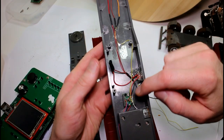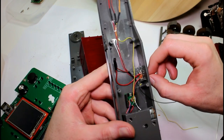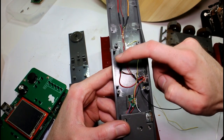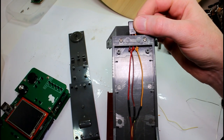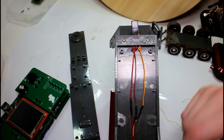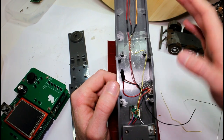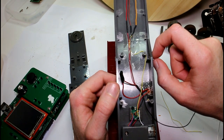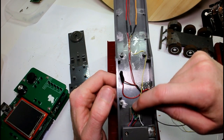I have the motor driver shield mounted in here. I've hot glued a little switch so we can turn it on and off. The little connector is for the battery and is hardwired to the connector at the front, which means we can charge the battery with the switch in the off position. It also means if you have the switch off, you can power the tractor unit without sending power to the lights. The orange wire going to the yellow is the signal wire — our UART receive line going into the shield.